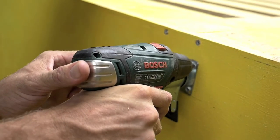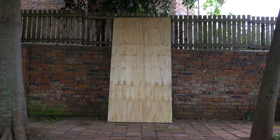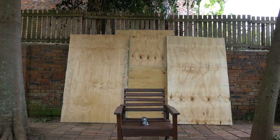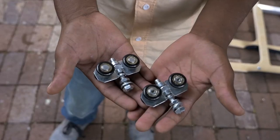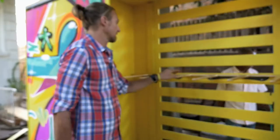Just a couple of the correct tools and you're away. We'll be using eight pieces of shutter board — four at 1.2x2.4 and the other four at 800x2.1 metres high. Industrial wheels, as many as you need to accommodate for the weight of the cupboard. Four rails, four of these guys, a couple of decking screws. We used two of Jasper Heels' surfboard racks for this cupboard.